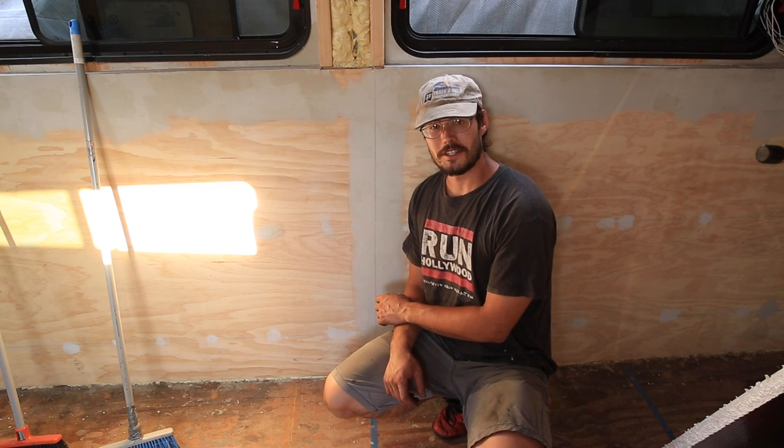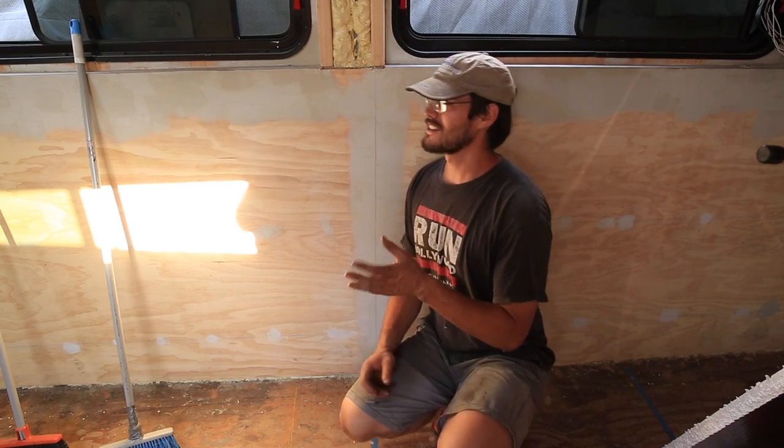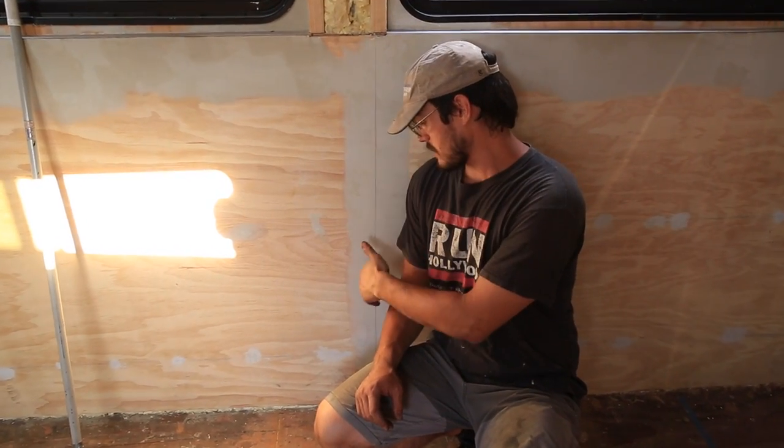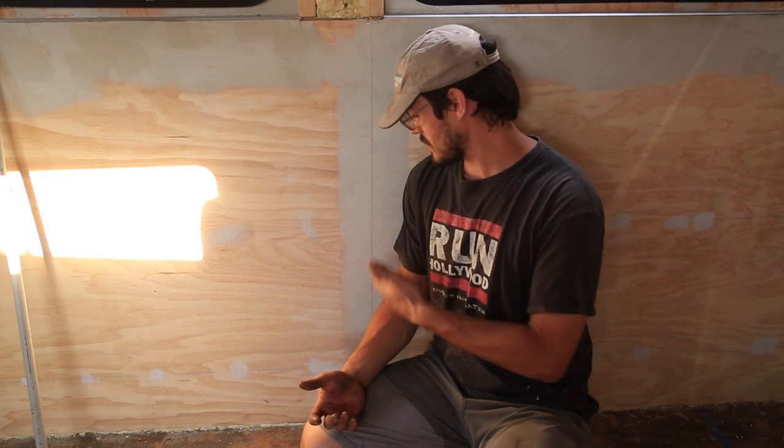Let's talk about this crack really quick. A lot of you watching are probably thinking, 'Oh my gosh, they're putting putty on the walls — it's gonna crack once the vibration starts.' Here's your chance to say 'I told you so.' We haven't had issues with cracking except at these larger butt joints. The plywood edges aren't completely fixed on either end, and the putty just wasn't strong enough to hold there. It was kind of an experiment — and the results are pretty plain and simple: the putty was not good for filling butt joints.